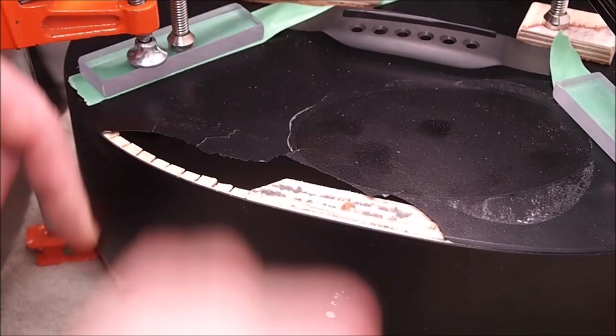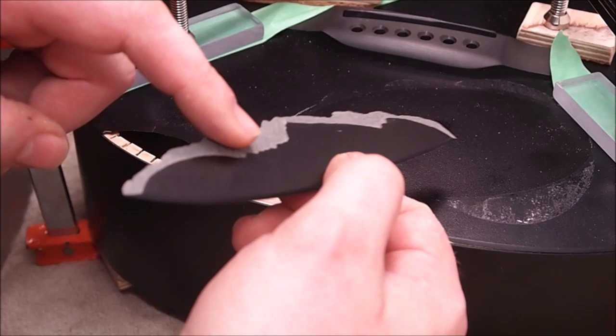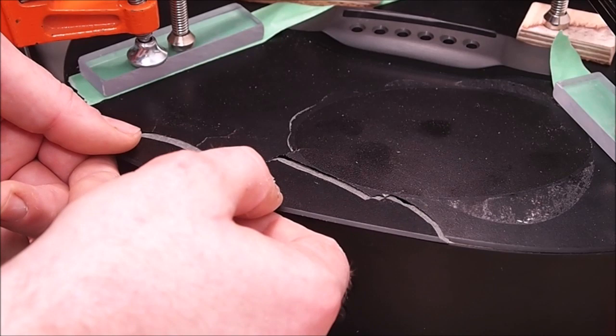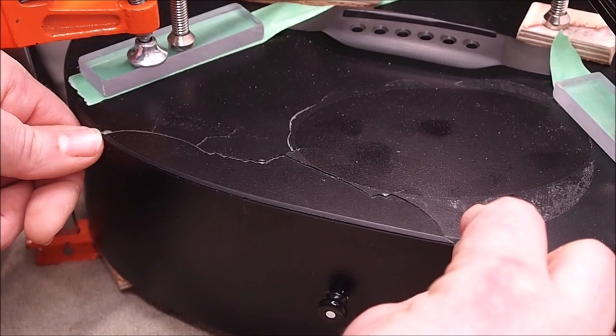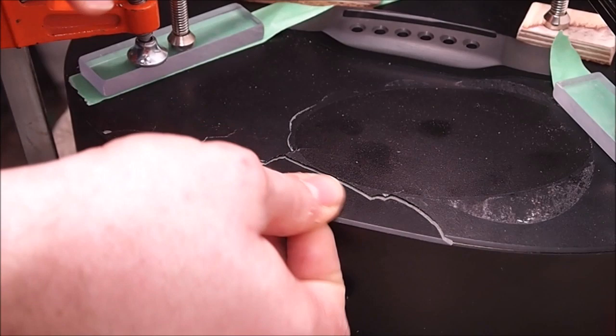The X-braces are clamped up to their ends - they're fully glued, and I can turn my attention to this great big gaping hole. In one sense it's a nice break in that we have this long leading edge at an angle. It's almost like a scarf joint - the two angles complement each other and hold things together pretty nicely. It keys into itself pretty well. There's always going to be a scar, we know that, but at least it's going to be relatively flat. The main thing is trying to find a way to clamp it flat while it dries.